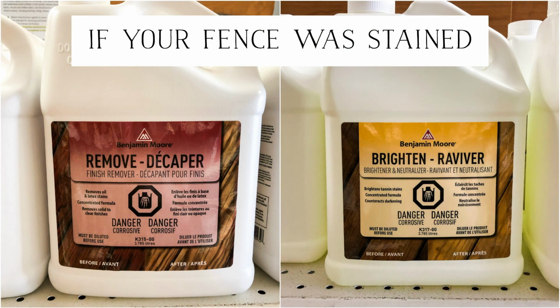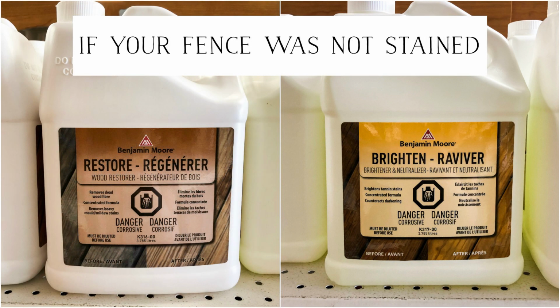It's actually quite impressive. So if you do happen to have used any new materials, put a new board in, in this case we've got a cedar fence. There's natural tannins in cedar. The treatment will actually pull the tannins out to prepare the wood for the stain. So once that is dried, you'll now have basically a restored raw wooden fence ready for your stain.